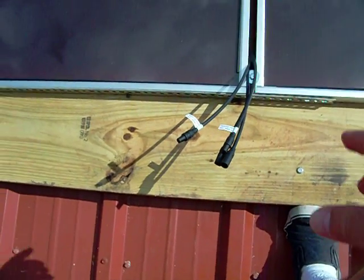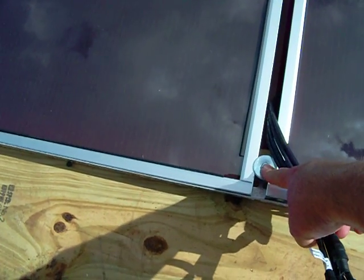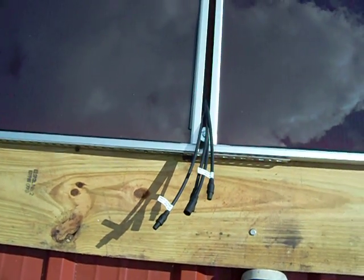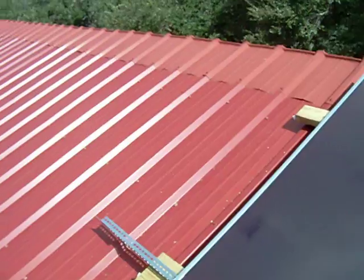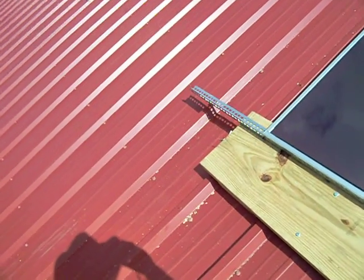In between the panels, grab the cables and get them out so you have room to maneuver. Then I use four-inch lag screws — you can see them here — with the one-and-a-quarter inch washers, and you put them in here to hold the panels down. There's one up there and one down here; this one I just need to adjust a little more to close it in. That's essentially how it works — it's pretty easy.